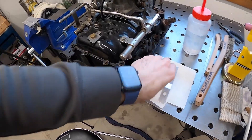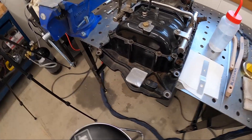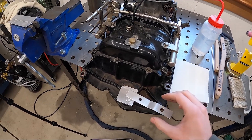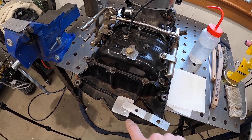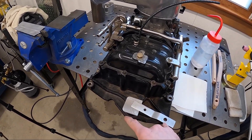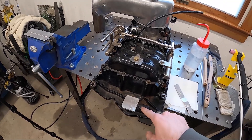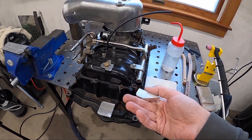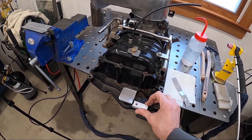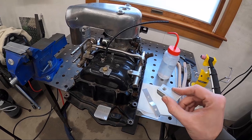I machined up this little block that sits down where the distributor sits — it's a pretty good fit. I also cut this little piece of aluminum that lines up with both holes, and I'm going to set up and weld this on with the bolt holes lined up. Then I'll be able to use this hole and this block to line up the bolt location for the distributor mount. I machined this block out of aluminum stock so it fits right where the distributor mount needs to go, then I can use this little jig to mount it on the new intake manifold and get it welded.